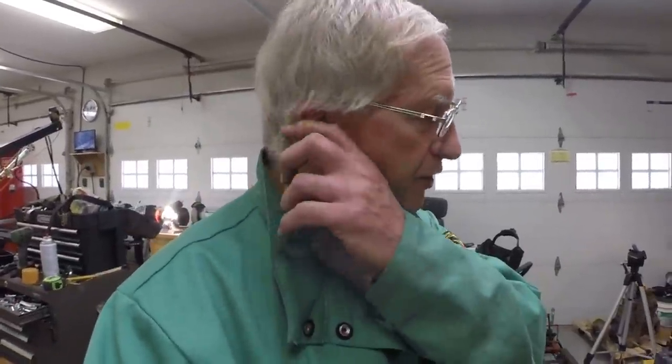And the other question is, why are you building the drives this way? I think if you go back to the first design episode and the first couple of build episodes, you'll learn that the only way I could use Cub Cadet components and independently control the tracks, that is, be able to drive one track forward and the other one in reverse to spin in place, which you can't do with an open differential and brakes, which is the way most of these things are built. I think my modification of the differentials and using them this way is unique. I don't think it's ever been done. If you've seen it done, let me know, because I've not seen it done. I think it's a unique application. I'm trying as much as possible to use Cub Cadet components.